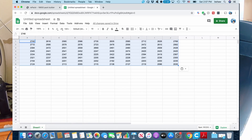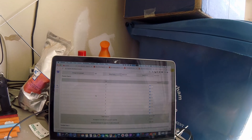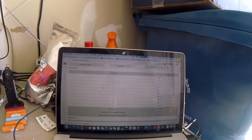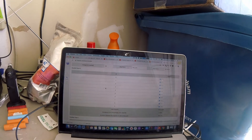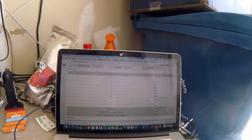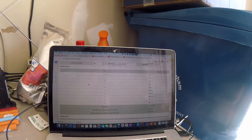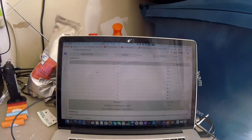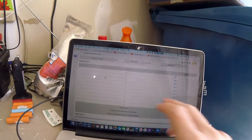I have done that — you put a hundred cells in and miss a comma, or put the wrong number on a cell by flipping a couple of digits. So when you put them in, just make sure you go through the cells again to confirm you have the correct milliamp hours and didn't transpose any numbers.